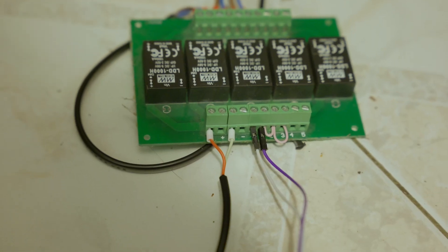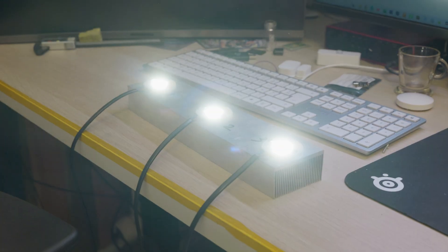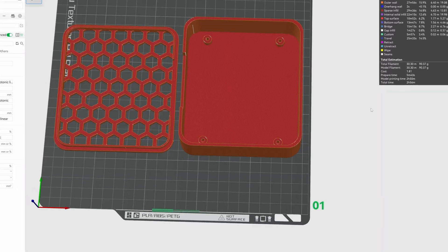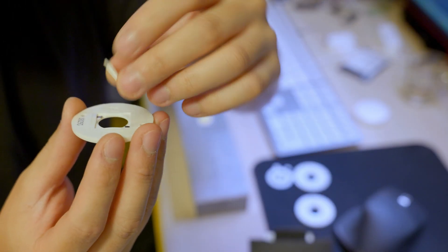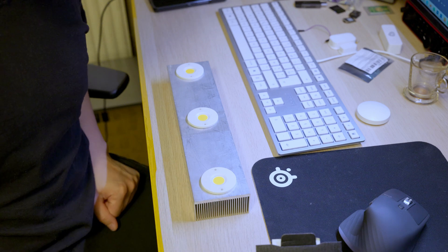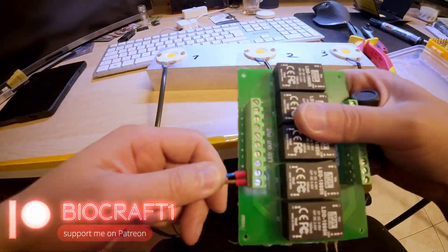On the ground is my first prototype, using a power supply, an LED driver, and most importantly a microcontroller that will adjust the brightness, since I'm not sure exactly what the plants need. Even though it's a prototype, I still had to make a case so I can run tests safely for a few days. It's printed with a material that can withstand high temperatures. The LEDs finally arrived — I wasn't expecting them to be that small. These holders really simplify the work, as you don't need to solder — just push the wire into the terminal. Based on the power output of commercial lights, I'll use three LEDs and dim them down if needed. If you're curious about the diagram and 3D drawings, I'll put a link below.